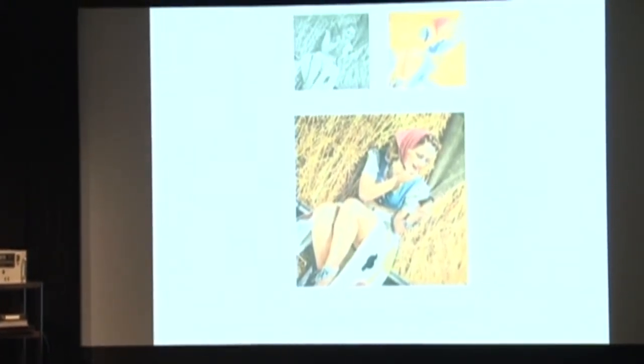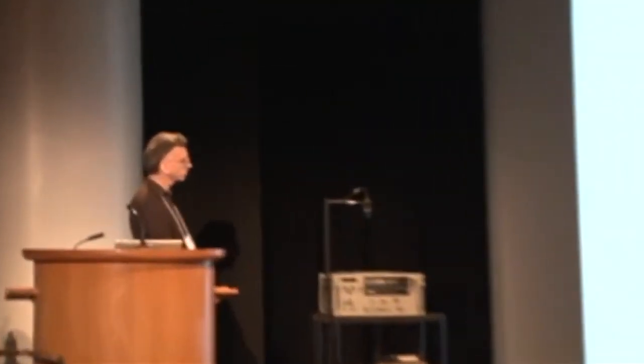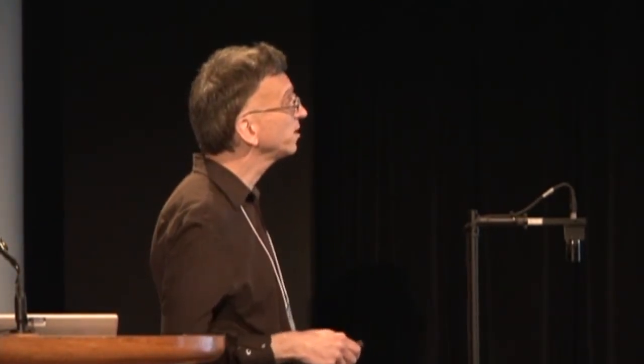So now let's take a look into the image itself. I got this out of a book on one of the theories of development of NTSC, and it drew upon the principle of color printing. They knew this for eons: if you take a black and white image and make it full resolution, putting all the resolution and detail in the black and white image, you can sacrifice detail in the color-only image, because when you add the two together, you get a normal picture. It's a very interesting principle.